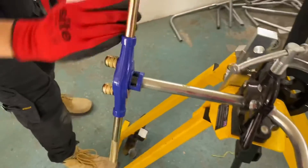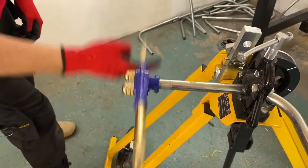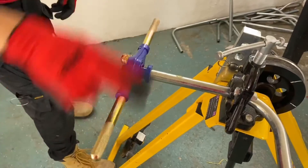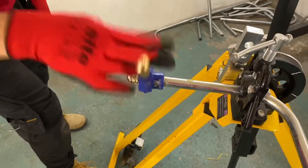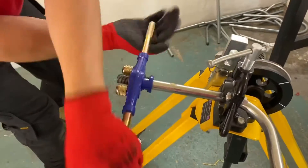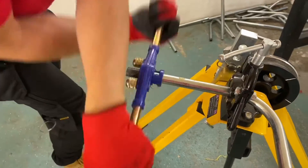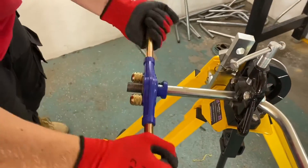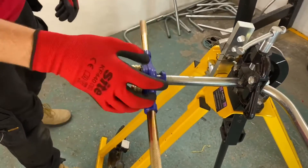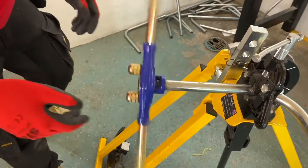This is a running coupler — we've got two pieces of conduit we want to bring together. What you can't do is build all the conduit system on the floor and lift it into installation. So you end up using running couplers, and also nipples — I'm sure we'll come back and have a look at a nipple in the future. Remember to leave your comments below if you want to see any other videos in this series. We're only going to wind this on loosely — there's no point in putting it on super tight because it's actually going to come back onto the other piece of conduit.